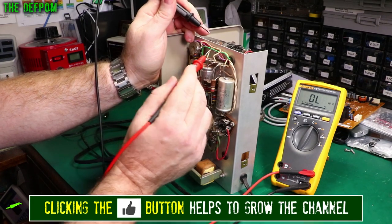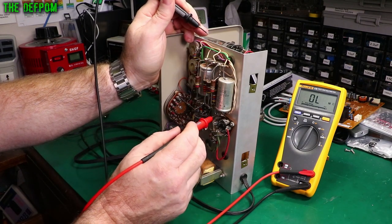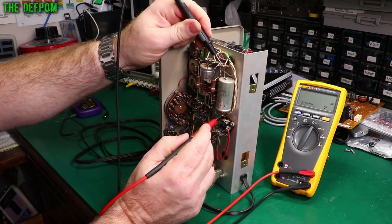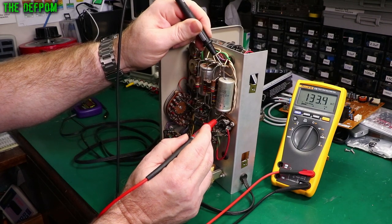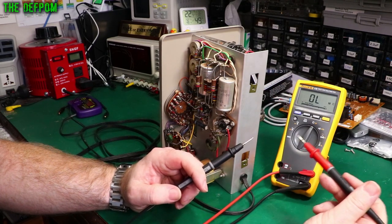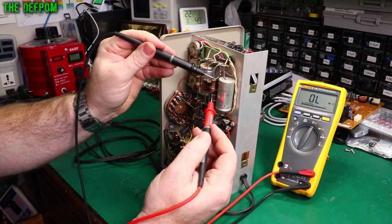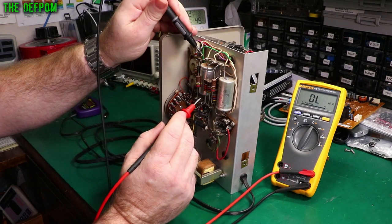How's that hooked up? There's a pink wire going to this one. These two caps are in series - there's another resistor here across this cap. So these resistors are probably here to provide balancing. When you've got two caps in series, you stick a resistor across both to give equal voltage across both capacitors. If you put two 200 volt caps on a 400 volt supply, you could end up with one cap at 250 volts and one at 150 - that would be imbalanced. The resistors act like a resistor divider so the center point is half the voltage, meaning both capacitors see the same voltage.